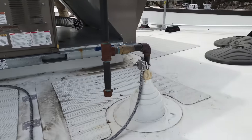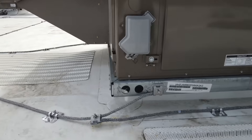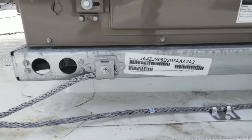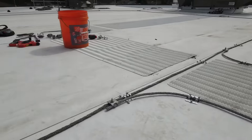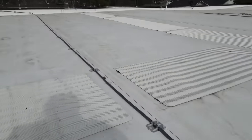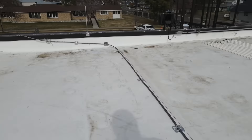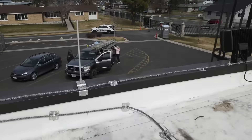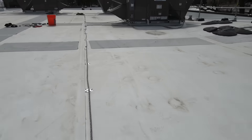Showing another gas pipe bond — nice sweeping radiuses, which is what you want. Mechanical bond to the side of the unit. Conductor in a nice straight line, fastened every three feet. We clean the roof before we adhere to it — this particular roof is adhered with M1.